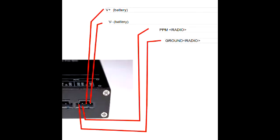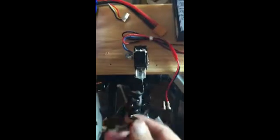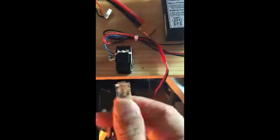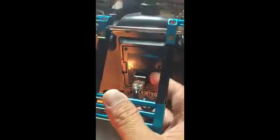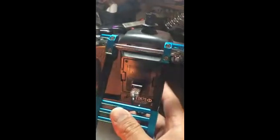The PPM wire and ground wire are connected to an RJ45 port — if you're in computers or networking, you know this port. I connected it to a 25-foot curly telephone wire and hot-glued it in so I don't accidentally pull it out. The other end of this curly wire goes to the back of my 9X transmitter — there's another RJ45 data port there that I hot-glued onto the unit, connected to the PPM and ground.